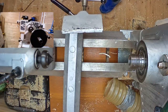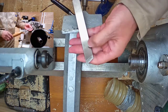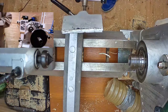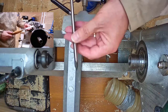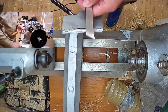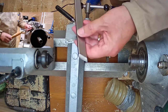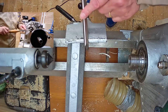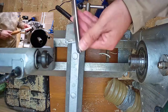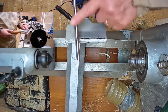Switching to the overhead camera - the standard skew is the rectangle, the original one that's been out since it was created. The next version I've got is a rolled edge skew - both edges are rolled over. The advantage is it slides better on your tool rest, but the disadvantage is when you have your long point down you're sitting on a round edge so it's not stable. Some wholesalers decided to have a rolled edge on the short point and a flat edge on the long point - so that's another hybrid.